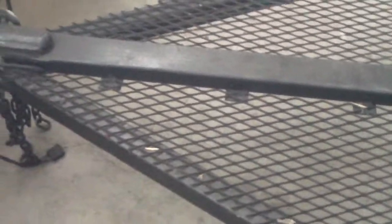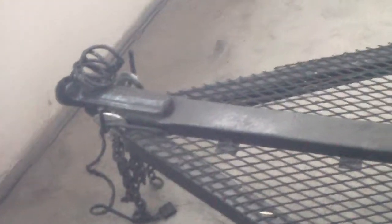I completely covered this with expanded metal mesh all the way across. It's a 2-inch ball hookup. I bent some 3/8 steel stock so I could hold my hook and chains right there — welded them on. It gets held up right here with the handle. I aligned it on center with this Texas cutout, and it just lands right on it.